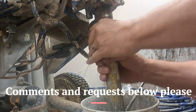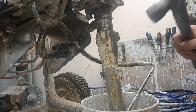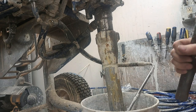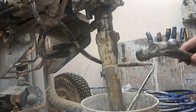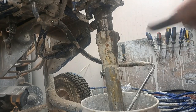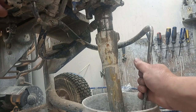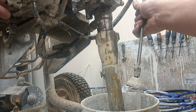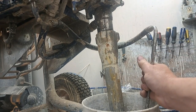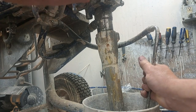Tighten the fluid section back up and hit it with a hammer — that's what you're supposed to do, it's recommended by the manufacturer. Somebody referred to this as carpentry work, but this is a ball-peen hammer, so steel work would be the correct term. You don't use a wrench — it will not get tightened properly that way. Now we're going to turn it back on and let it prime back up. It stopped — that's normal.